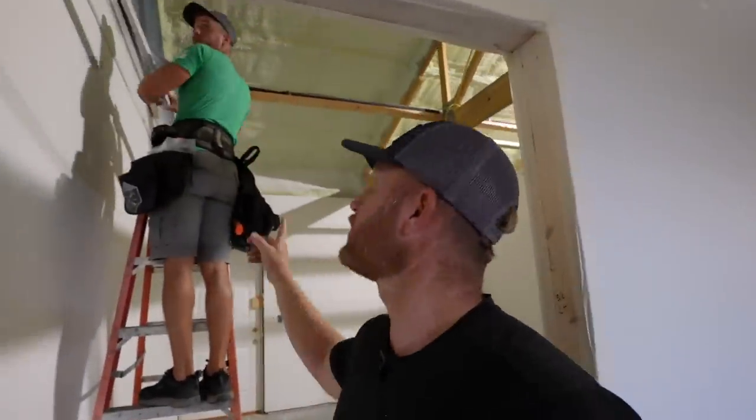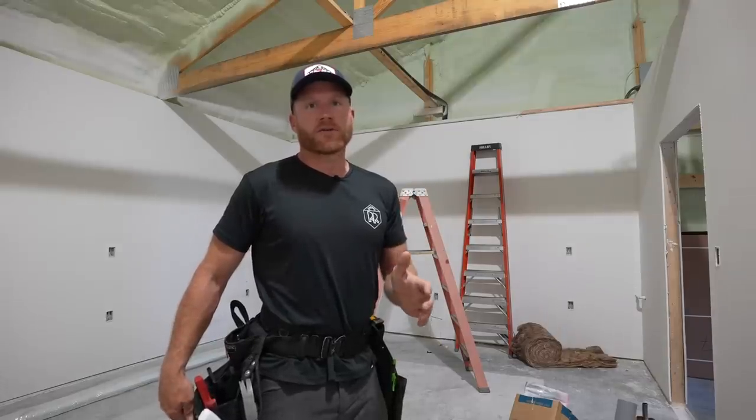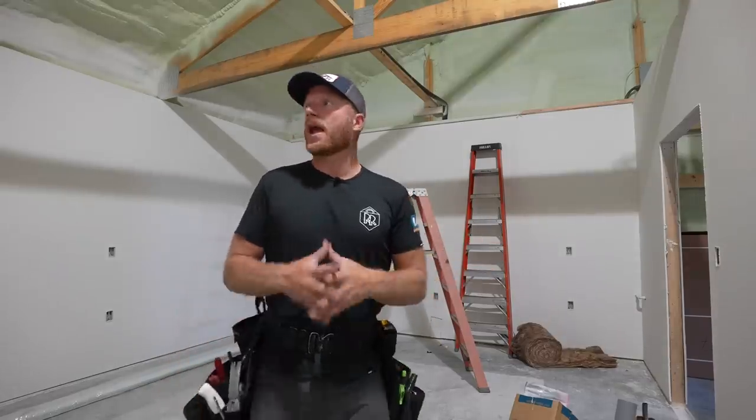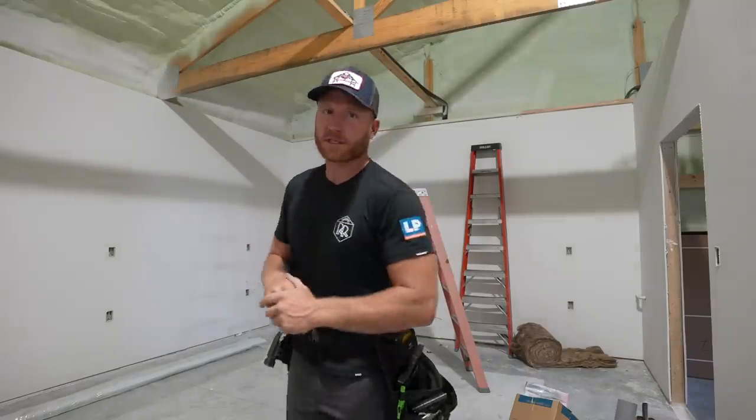We're in the garage. Greg has already started here while I was getting my stuff ready. We're gonna be trimming out the two rooms here in the garage. We're gonna be getting our steel ceiling up and we're gonna get going on this interior. All right, now we're not doing anything crazy in here. We're just putting up a simple white metal ceiling, very clean. I think it's a good look for a garage room like this. And cost-wise, you can't really beat it. So I'm just gonna go around the perimeter, I'm gonna install the J-channel, and that's what the ceiling metal will go into. So let's get into it.